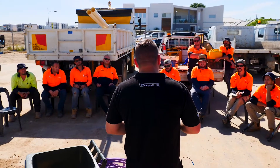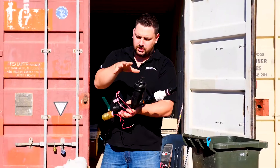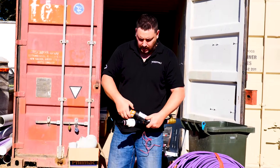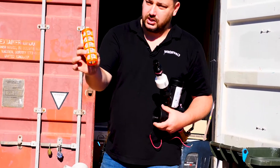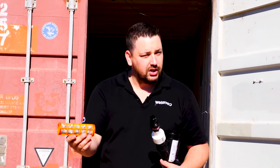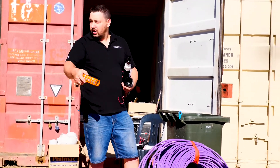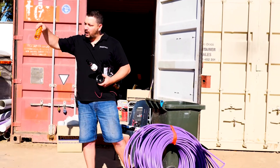From the solenoid valve for a drip system, you go into your filter. The filter is basically a screen — some have discs, but in this project we've gone with a screen. It's just a mesh that stops debris. Being a recycled system, we don't know exactly what's coming through the network. You can see on your drip tubes there are small holes — we don't need those clogging up, because with all the money in plants, if that clogs up you'll have plant loss. It's a flow-on effect.